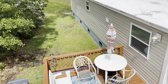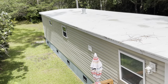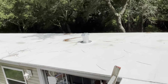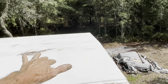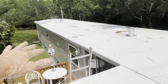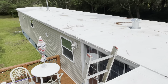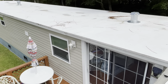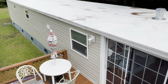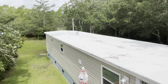That's the underpinning, and then the rubber roof with the overhang, and then the cool seal. Now we just added a couple vents. Talking to him about this — if he feels like he needs it, he can put more vents up here. He does have a dehumidifier running inside this place year-round, 24-7. I recommend that for anybody who has a mobile home — get a dehumidifier and run it inside your house because moisture just happens in the attic areas and the floors, and a dehumidifier will draw all that out. Anyway, hope everybody enjoyed the video. If so, give me a thumbs up and I'll see you on the next one.